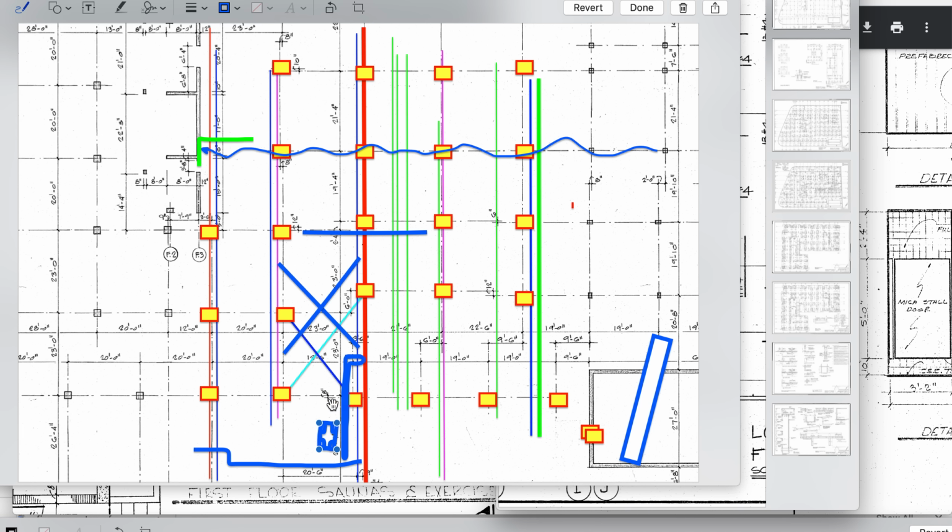Oh, wait a minute. That's offset by 8 inches. Oh, great. So I don't even load this equally. I'm pulling partially on this one and partially on this one, but not equally across each one of them because these columns are offset. So I load this one here. As I'm loading this one, I'm tearing at the outside corner of this one a little bit because they're 8 inches apart as I come back, and which pulls on this side. As I strain it, I come across. Now I transfer the loads back to this one.